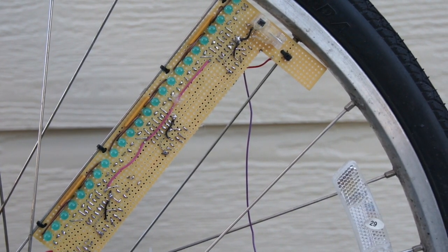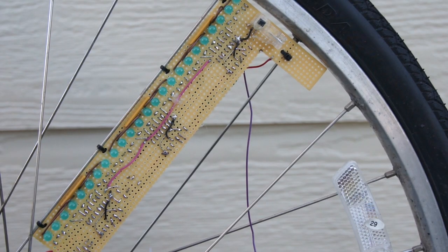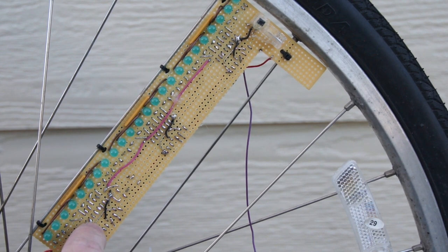As you can see, there's no copper on this perf board, so everything on here is a lead. There are two coming through, and they bend back together, and I soldered them together that way. It would be really nice to have the stability of actual copper cladding, but I didn't have that on here. The longer leads are from the capacitors I used on the shift registers — that was a convenient way to tie that in. I put the tiny little ceramic capacitor underneath the IC socket.